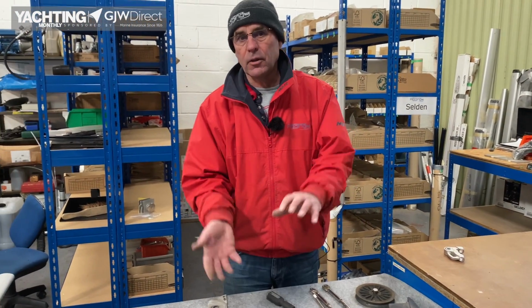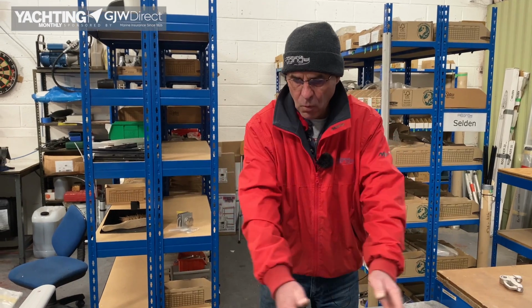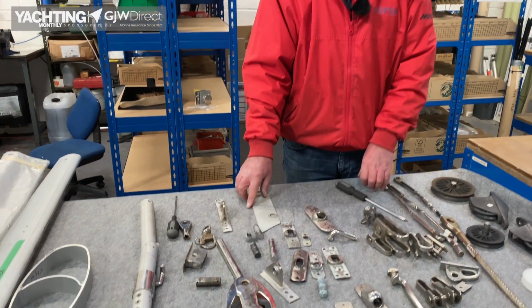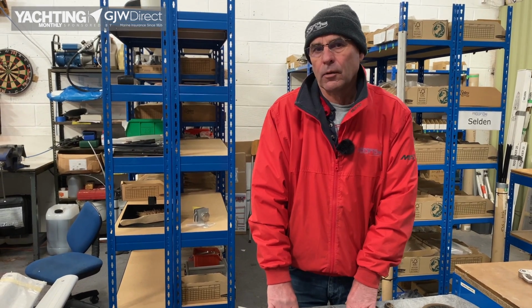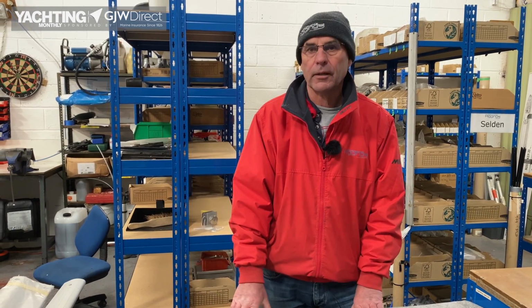And if you can't put your nose against it, if you can't really get close to it, you've not inspected it, turn it over. Look at the threads. It is all easily visible, and you don't have to have a degree to see some of these issues. If you have doubts, you can then obviously call in your local rigger to come and have a look and give an opinion, because he'll have obviously vastly more experience. But just have a look, it's an eyeball thing.